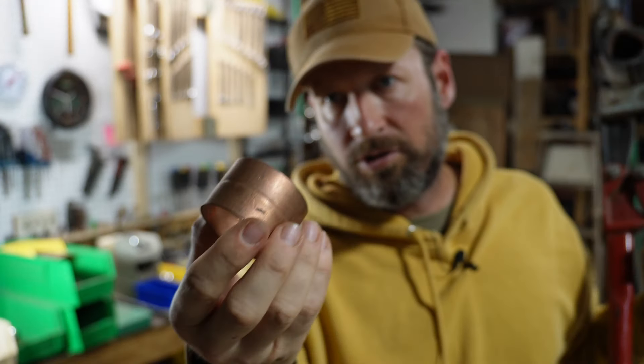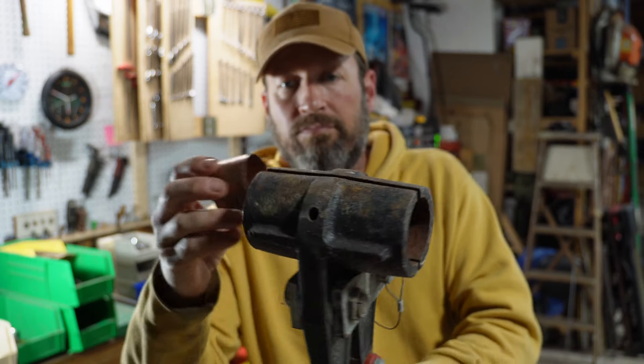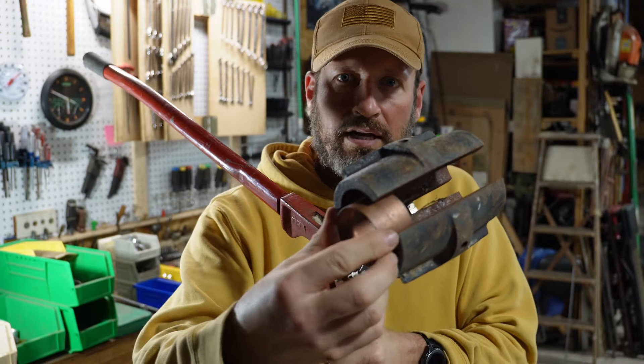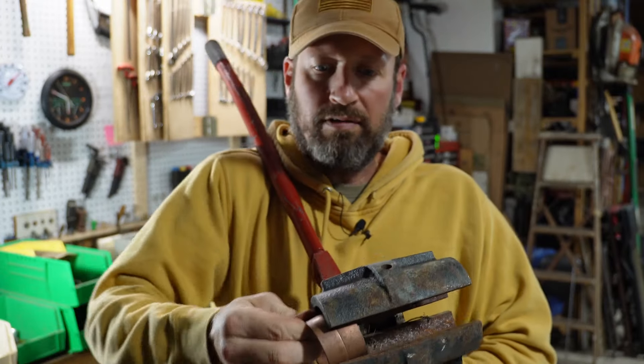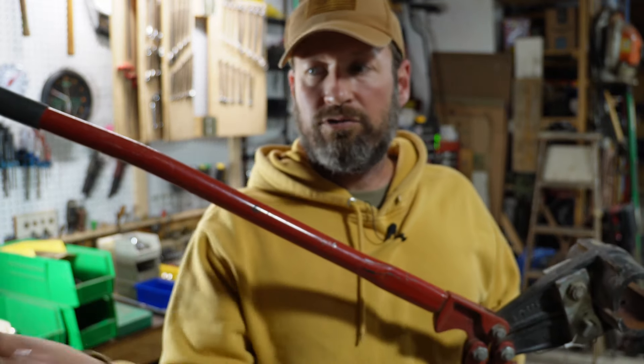This is just a coupler, so it's a little bit bigger diameter than regular two-inch tubing. But you would put this in there — if it was kinked, just slightly kinked, oblonged, ovalled, anything like that — you could put that chunk in there and work it around to re-round a bit of that copper pipe. That way you don't have to throw it out or cut it, or if you're doing some rework where you've got to put a coupler on it, you could slip something on there after you re-rounded it.